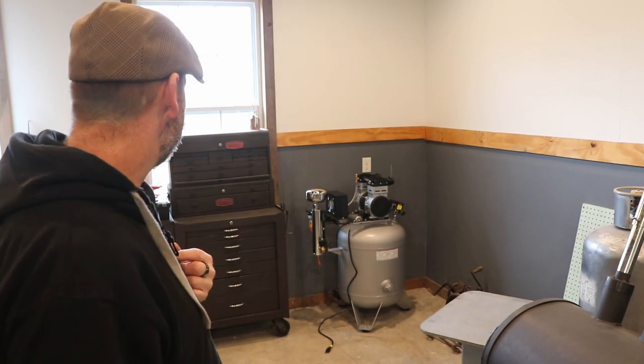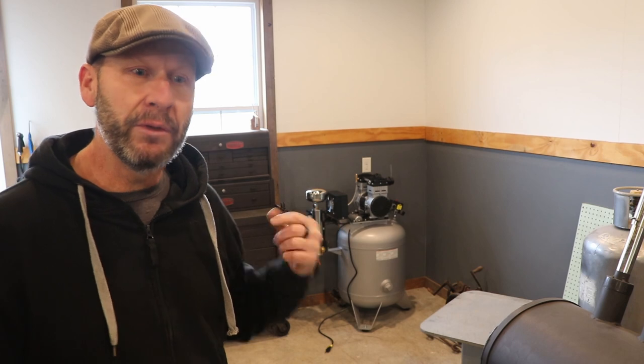I've got a little kit also behind the camera with some fittings to plumb the airline. And yeah, shouldn't be a long video. The goal is to get it installed. I'll probably run this black tubing through EMT conduit, it's so curly, you'll see. It's kind of a mess, so I think I'm gonna put some EMT conduit on the wall, then run the black 10 millimeter airline through, and then we'll get it hooked up to the mill and fired up. Let's do this.